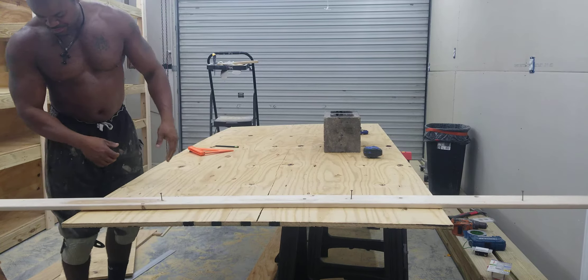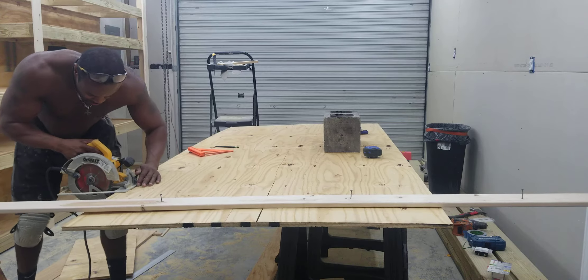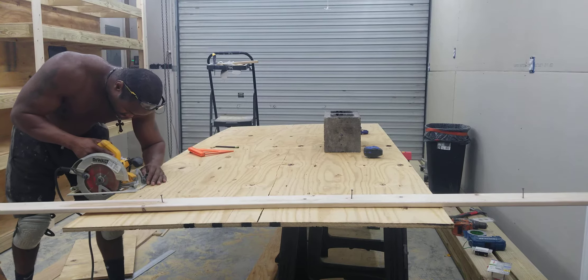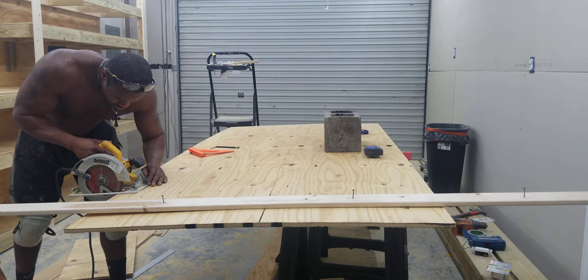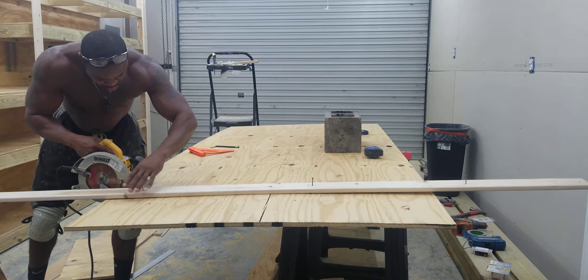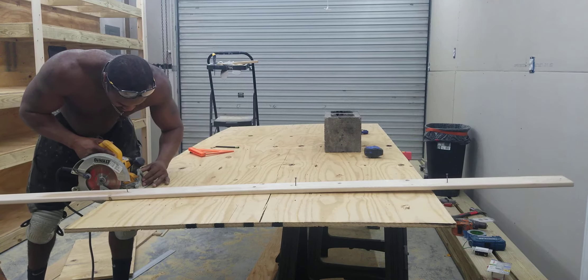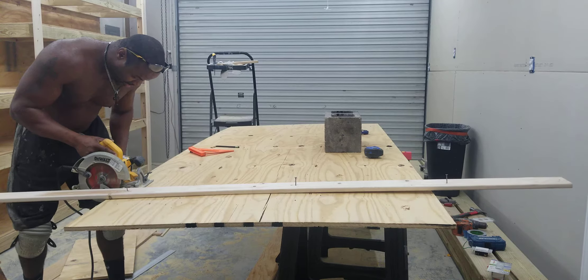So what I do here is I take my saw and I put the blade right where I want it to cut. That's there. This part's important — you want to make sure this is as straight as possible on both ends. It just makes later on, when we're doing an adjustment, it makes it easier. Now I've got my blade right against it. I've got my distance. I can take this away.